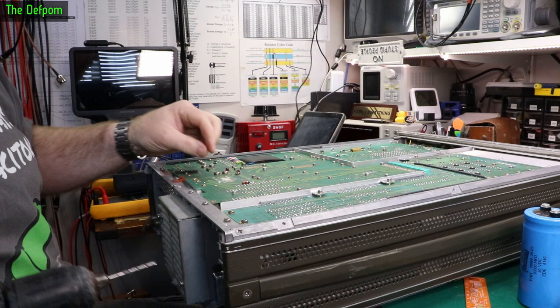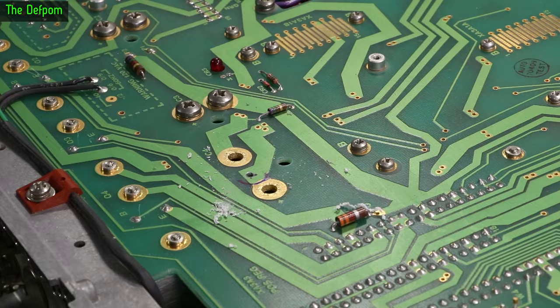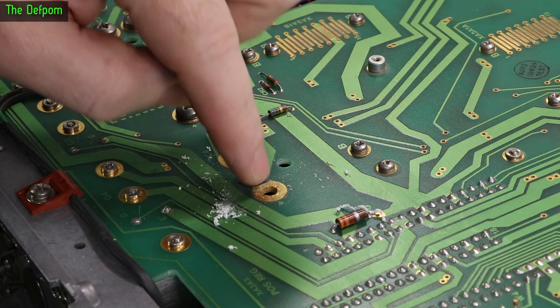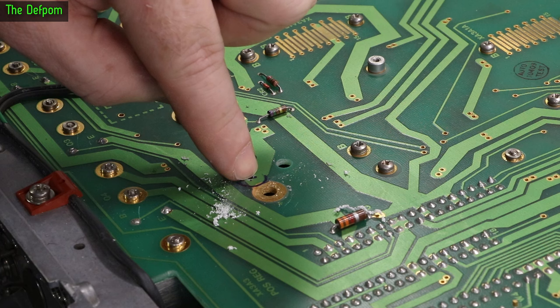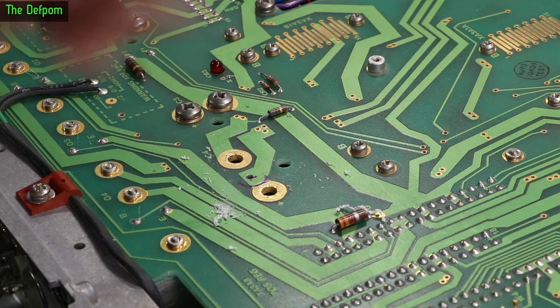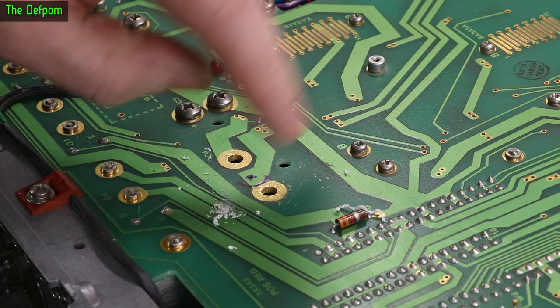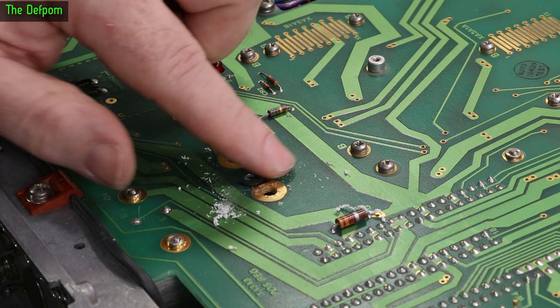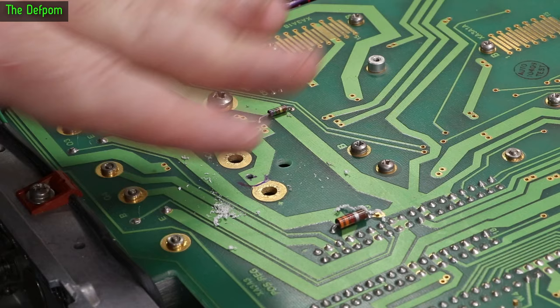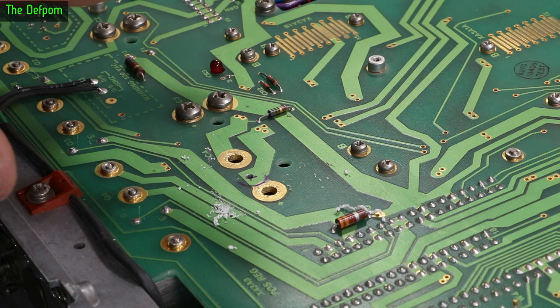One little hole drilled. Give it a double check — looks very close. There's the original mount hole and I need to move it slightly closer. I always start with a smaller drill bit first because it gives me room to get the positioning right, then I can tweak it going to a bigger drill size. I've got a big pad right here which means I've got space to put the screw onto. I've got to take the solder mask off here and tin it — put some solder on to tin it so the screw beds in without going straight into thin copper, giving it a bit more surface area and making it more robust. I could put a copper washer on there, but I'll probably just tin it.